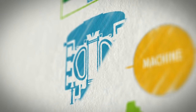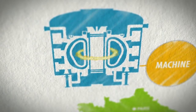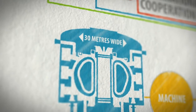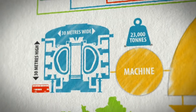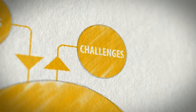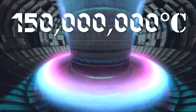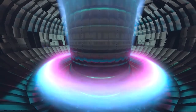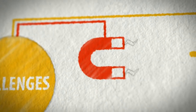The second main goal is to achieve a burning plasma — the state in which the plasma fuels itself perpetually without much more input energy. This is the whole concept that makes fusion a virtually limitless resource. ITER will sustain plasmas for up to 400 seconds at most for its studies, but future power plants will maintain their plasmas continuously for months or even longer.